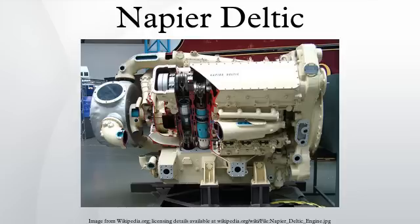Being an opposed piston design with no inlet or exhaust valves, and no ability to vary the port positions, the Deltic design arranged each crankshaft to connect two adjacent pistons operating in different cylinders in the same plane, using fork and blade connecting rods — the latter an inlet piston used to open and close the inlet port, and the former an exhaust piston in the adjacent cylinder to open and close the exhaust port. This would have led to firing in each bank of cylinders being 60 degrees apart. However, it was decided to arrange that each cylinder's exhaust piston would lead its inlet piston by 20 degrees of crankshaft rotation, allowing the exhaust port to open well before the inlet port and the inlet port to close after the exhaust port, leading to both good scavenging of exhaust gas and good volumetric efficiency for the fresh air charge. This required the firing events for adjacent cylinders to be 40 degrees apart.